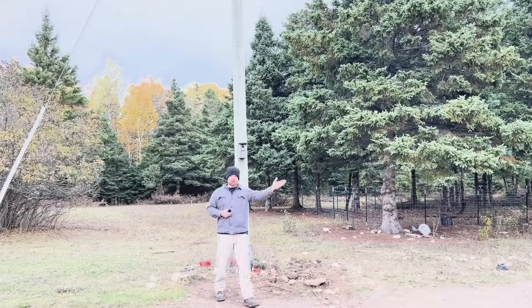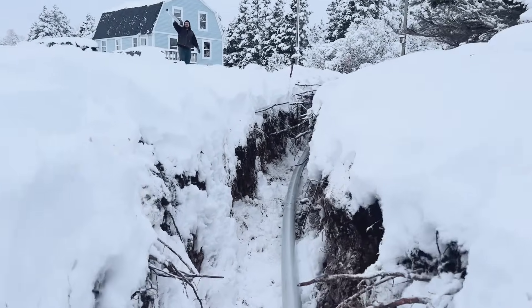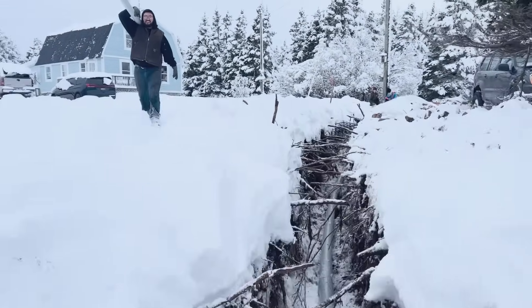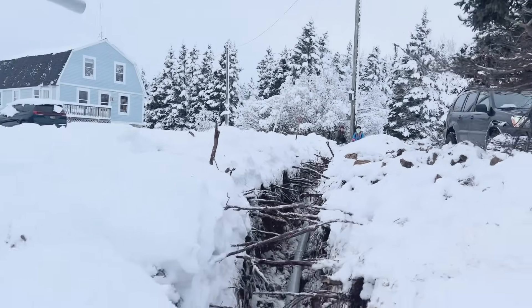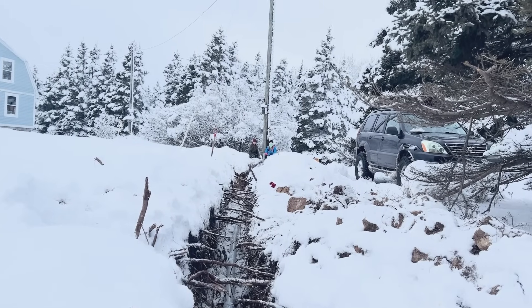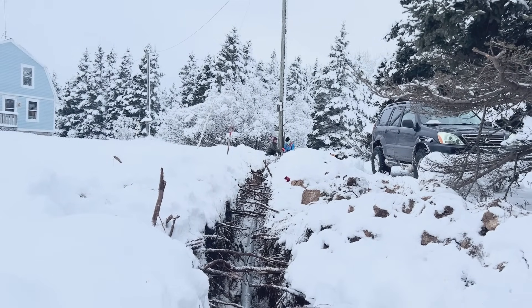If you have to make bends to go around a tree or something like that, Schedule 40 conduit actually bends a little bit. If you don't have to put any 90 degree 36 inch bends in your trench, you're much better off. You don't want to get it buried and not have your power company be able to pull that wire through because you've got way too many bends.